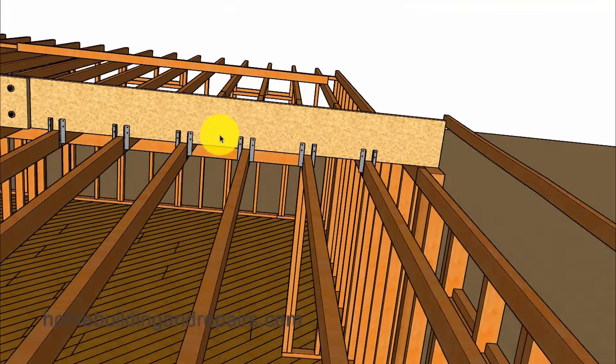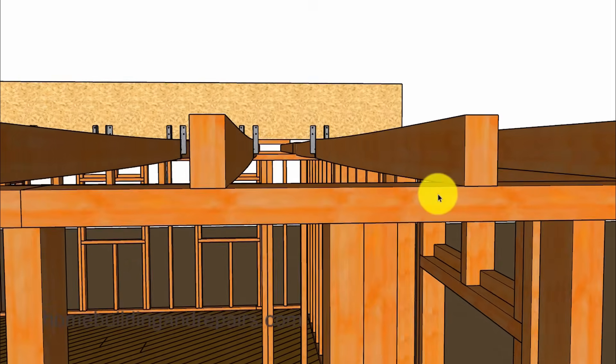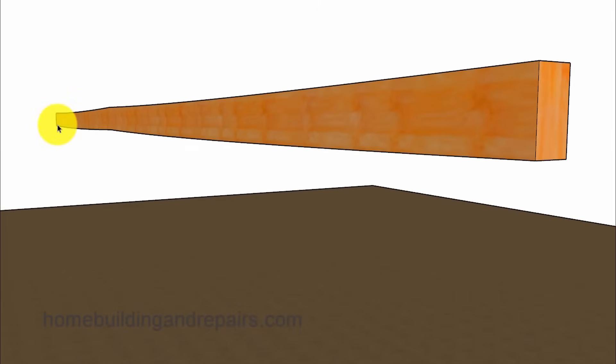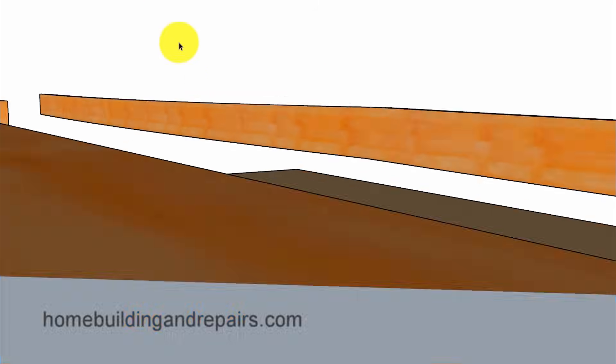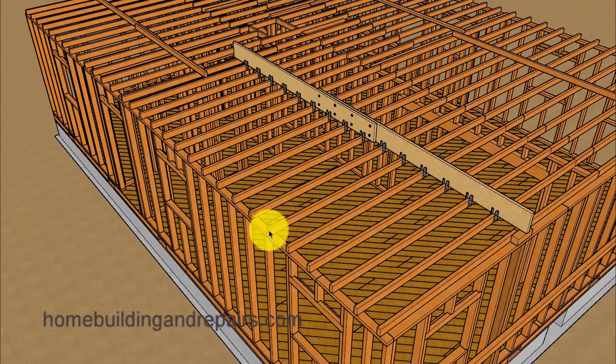Last on the list: if you're dealing with deformed lumber that is sagging, when you pull it up in the center all you might be doing is straightening the center of the ceiling. You could still end up with a sagging point going from the wall to the beam, and again from the beam to the other wall. I drew it in here to give you an idea. The original joist may have one long sag, and when you pull it up in the center you might end up with another sag going from point to point — so you may take some sag out but you won't end up with a flat ceiling.